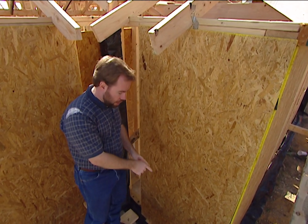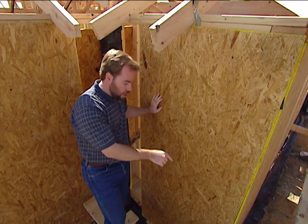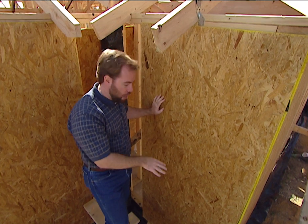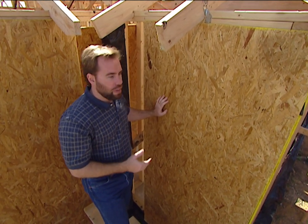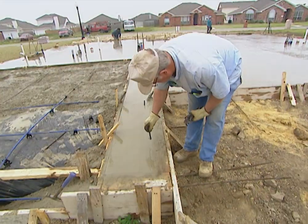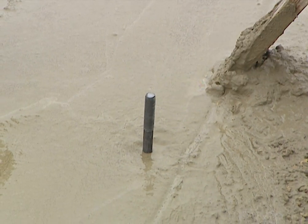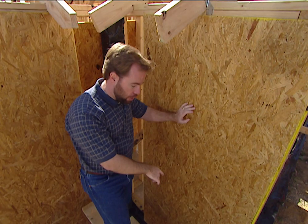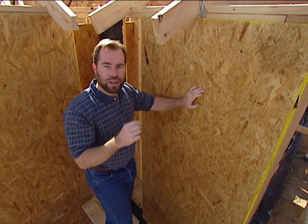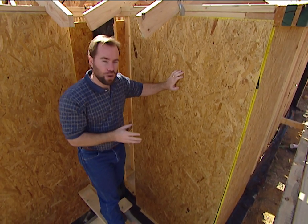The last place we have to check is where the house ties into the foundation — that would be the next place where it could come apart. A lot of times builders will just nail the bottom of the frame into the concrete foundation, and that's okay for building a house but not okay for a heavy storm or an earthquake. We need to do better than that, so we put in L-shaped bolts when we pour the concrete foundation. Once the foundation cures and we're ready to frame, we drill holes in the bottom plate, set the wall over the bolts, put on a washer and a nut, and that bolts it down into the concrete so it's not going to pull up in high wind.